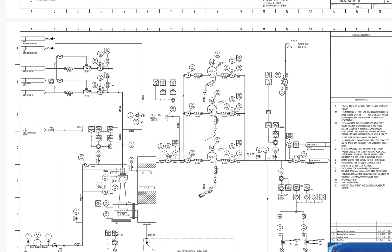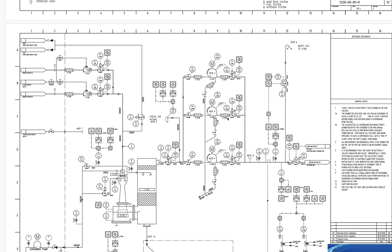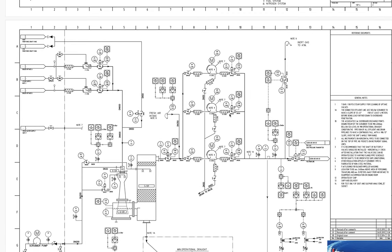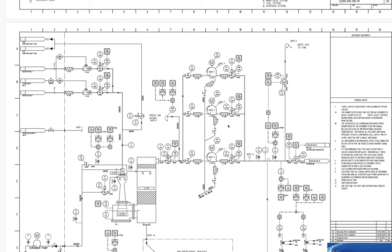Here we have three fans — three IGS blowers. In case one gets damaged — and it's really really easy to get damage on these fans, such as a transformer burning — you can interchange them. If one motor overheats, you still have these two others. This is the first time I've seen three of them; mostly the vessels I have worked on have two. Probably two of them are working and one is in reserve.